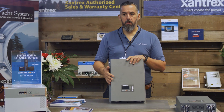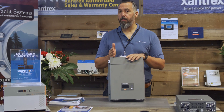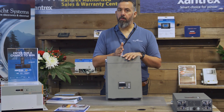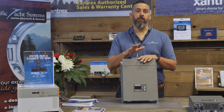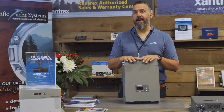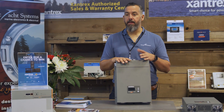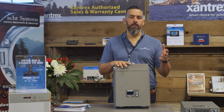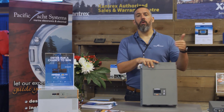We'll end up putting this on board and it's going to be great for charging the batteries. Remember, an inverter charger is a single output device, so it can only charge one battery bank. If you have multiple battery banks you're going to have to install an Echo Charge — a Xantrex product — or another battery combiner, like a Blue Seas automatic combiner relay or a BEP voltage sense relay.